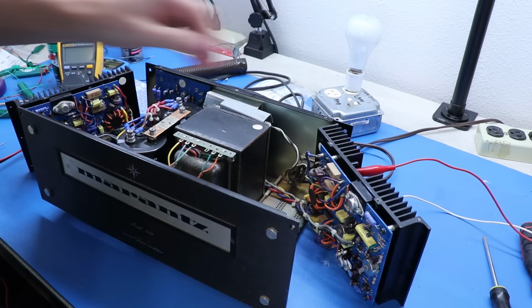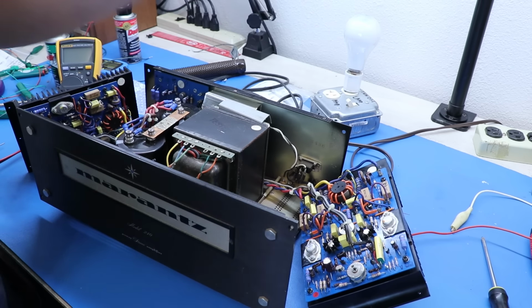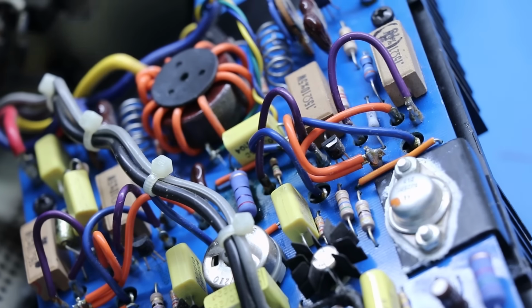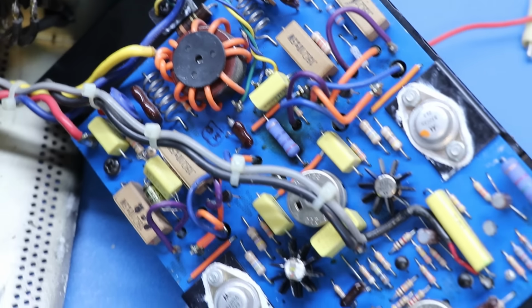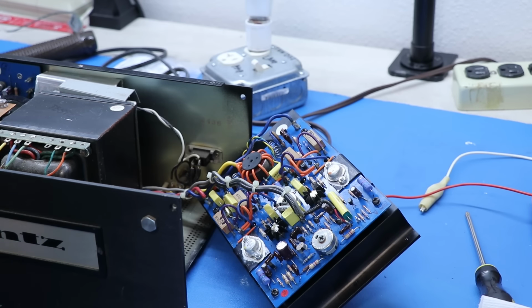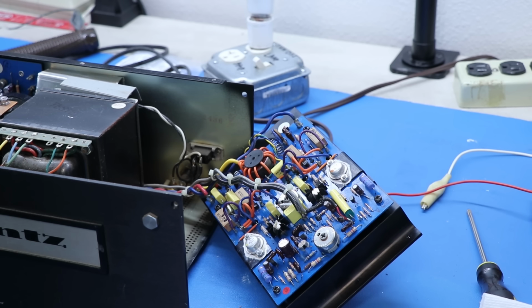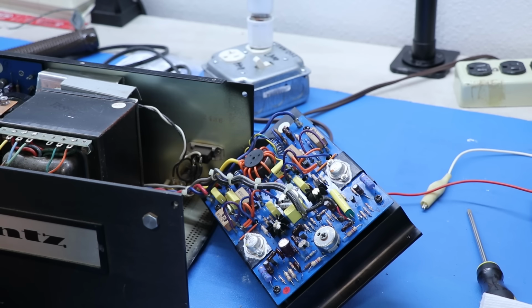Oh, that took a while. But I guess the only thing notable, in my opinion, is we take a look at the resistor in the middle here. Oh, there goes my clip. I don't remember what number it is, but it's this one here. You can see that it's all toasty back there, and that makes sense because what was in that spot originally is not the same value resistor as what's in the schematic. So I think this had been apart at one point, and that got replaced with a similar value. I think it was like 35 or something when it's supposed to be 27. So, that's kind of annoying, but, whatever. It's a good thing we're going through this, right?